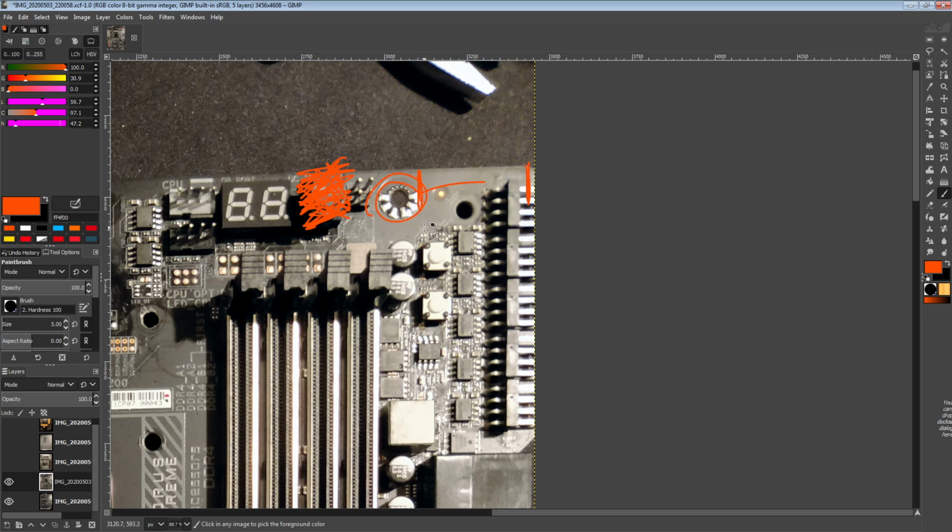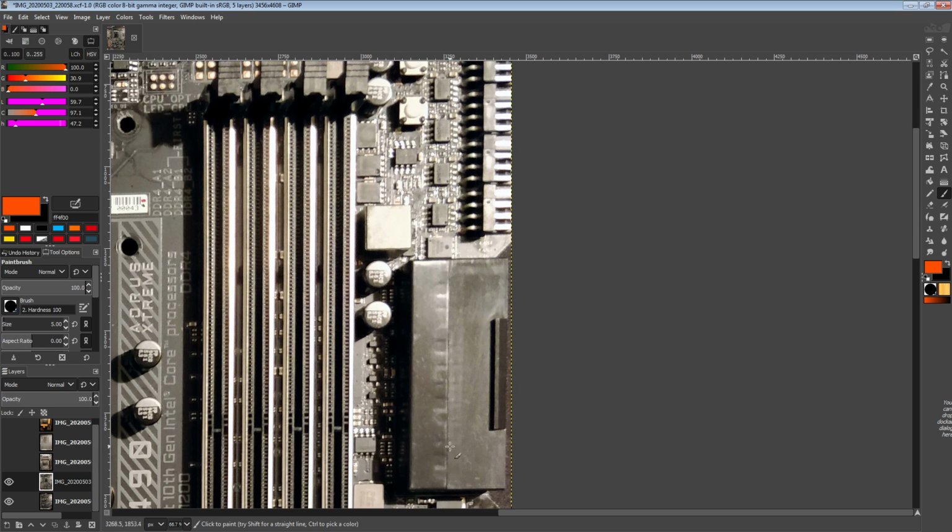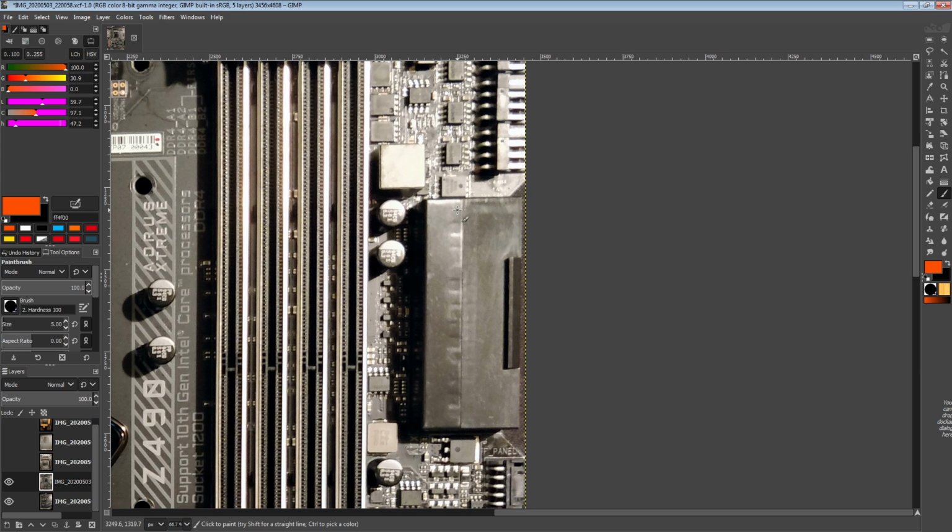Because that's where your ATX board's supposed to end, like by the actual mounting hole. And, well, it doesn't end there. And then you have the right-angled 24-pin, and Gigabyte does sort of recess it into the board a bit, but nonetheless, that 24-pin is going to be sticking out of the motherboard to the side. So case compatibility with this board, especially in terms of cable management, is going to be something to watch out for because, yeah, that 24-pin is just going to stick way out of the board.